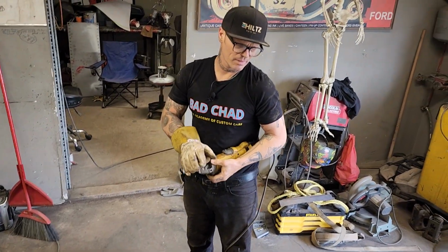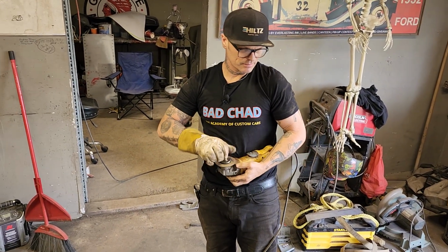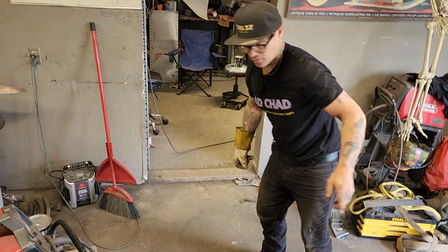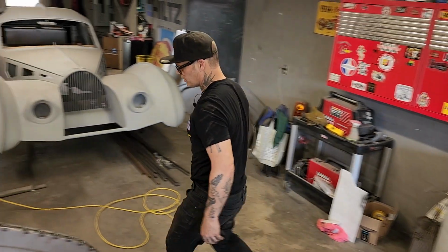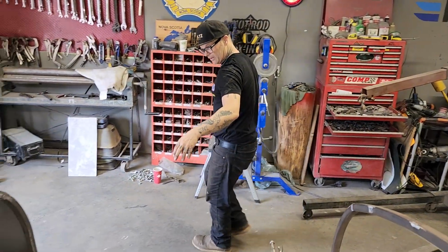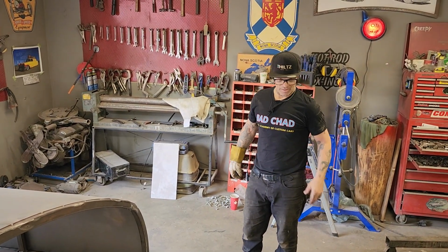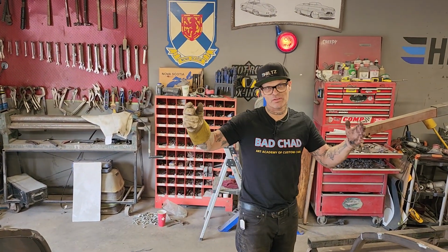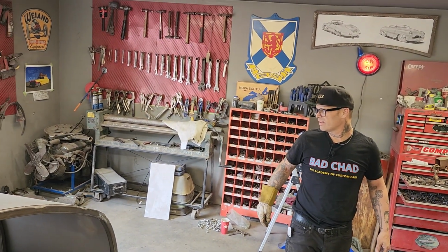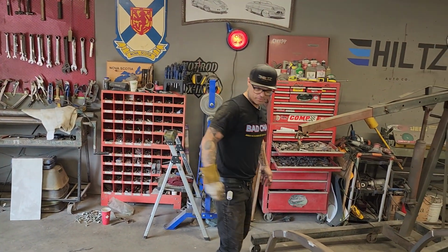Yeah, so basically my consensus is, and I asked Nate, the oil pump itself is what supplies the front crank, all the bearings. It supplies all the bearings. The only way that would ever starve of oil is if the pump stopped pumping oil. Also, when it gets pumped up front, he was saying something about the chain. The chain would throw oil all around the front. You have to remember too, if you were going up a hill, would your crank bearing be sitting in oil? No. So basically, the pump is what supplies it.